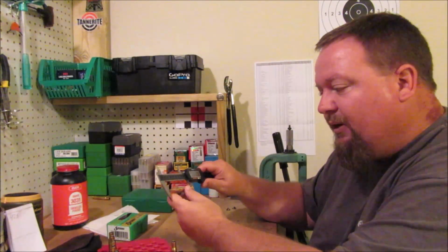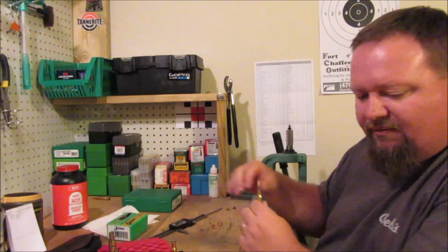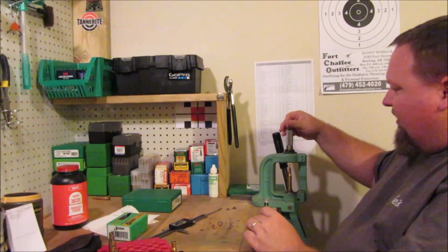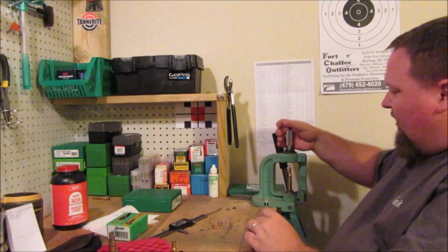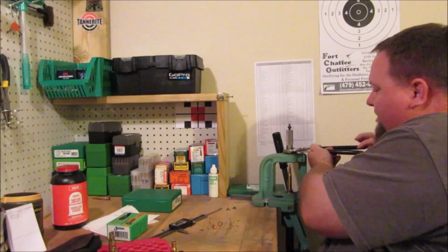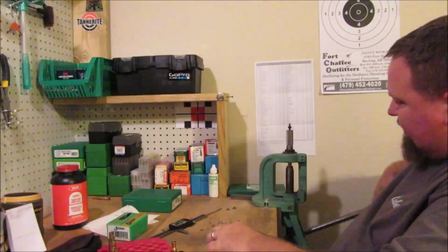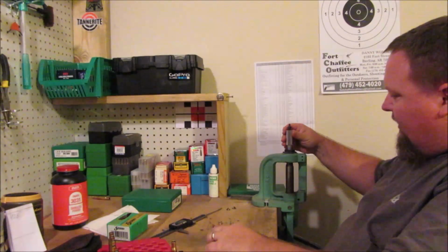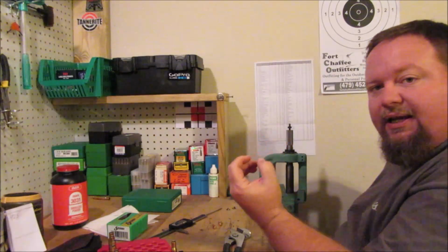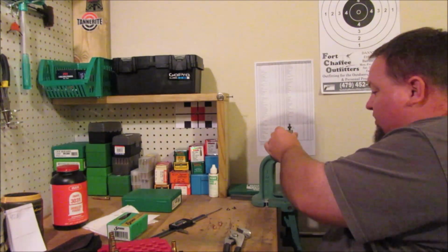3.31, I'm sorry, 3.31. And we'll check this and make sure that's our average. Now that we've got the depth where we want it, let's back this off. Let's loosen this up. Okay. Now let's run this down. We start feeling a little pressure. What we're going to get here is a little bit of crimp on the brass. We don't need a lot, just a little bit.